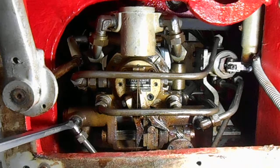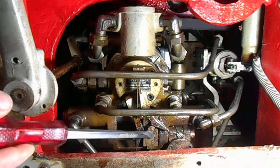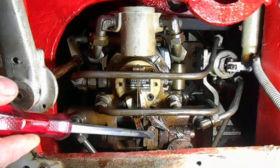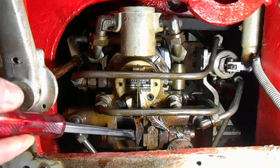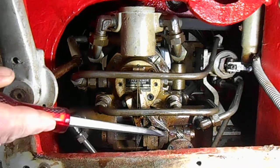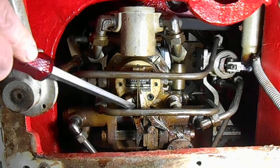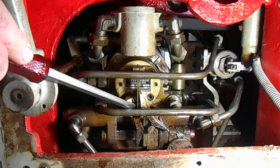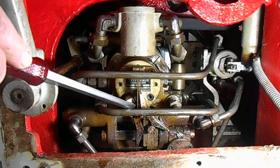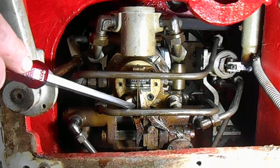Depending on which way the travel's moving. And that, in turn, shifts the pin over here, which is adjustable for the speed, adjustable up and down on this yoke. It moves the pin over, which rotates the cam inside the pump that changes the flow rate to change the speed, and changes the pumping direction inside the pump.